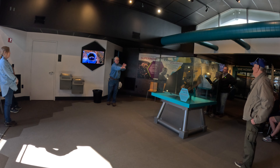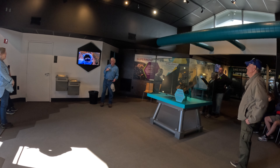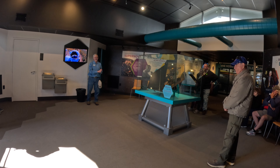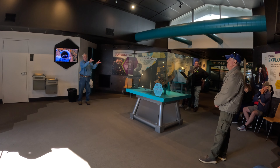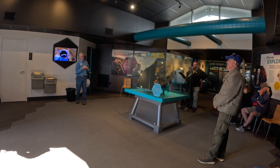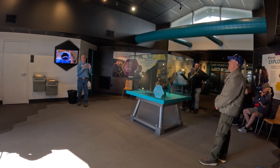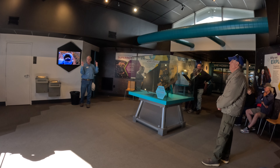Behind each mirror and above the turquoise truss, there is a mechanical stage with three hinged levered arms driven by electric stepper motors. That stage is made out of a super high-tech steel called Invar — like Zerodur, it does not expand or contract with changes in temperature. These three electric motors allow each mirror the ability to tip up and down, tilt back and forth, or piston in and out. The first thing we do each night, before looking at the sky, is stacking and realigning all these mirrors so they work as one mirror.